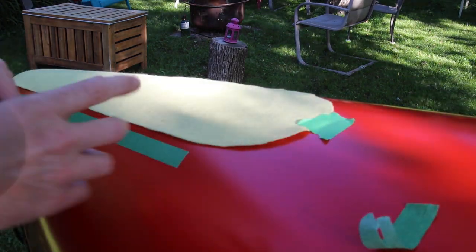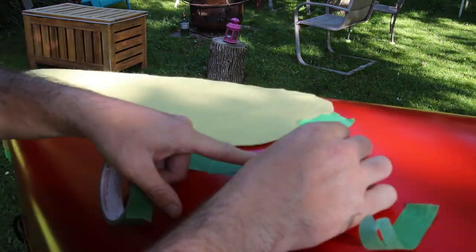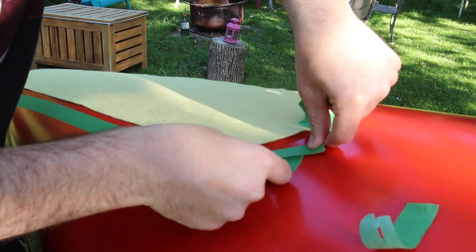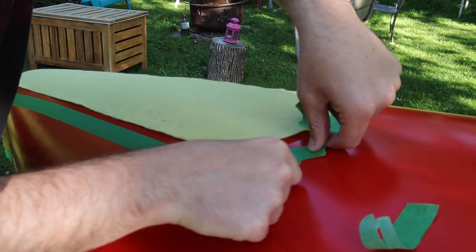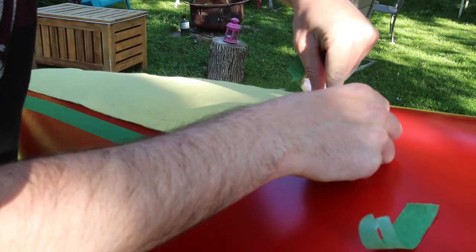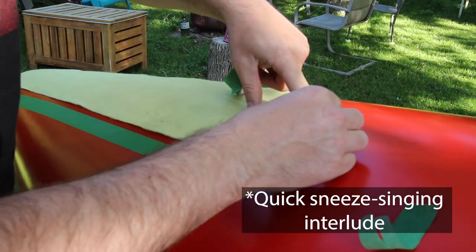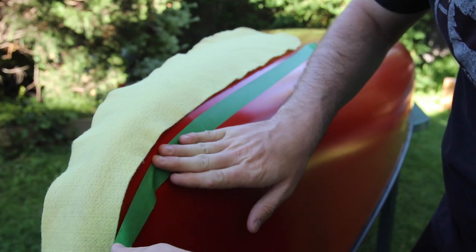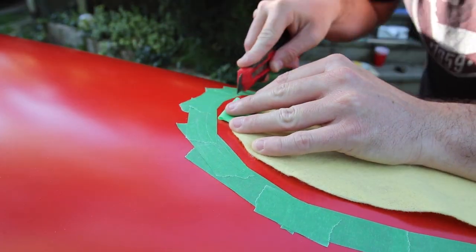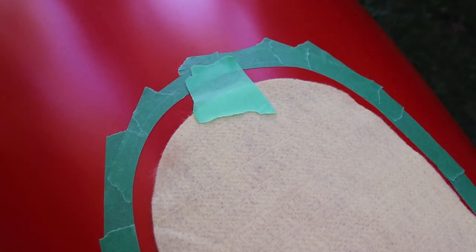I tried my best to keep about half an inch around the outside of the patch so that the epoxy could create a seal around the outside edge of the skid plate. This also makes for a nice clean finish when you remove the tape at the end. I used a few different techniques to do the rounded corners, with some smaller pieces or just trying to use one large piece and pushing it into place. Either way, I ended up taking a knife to clean up the corners.